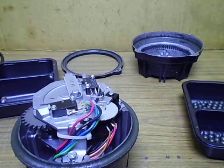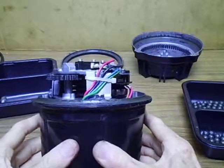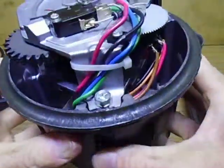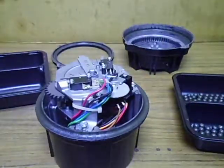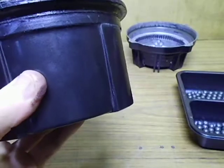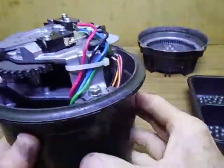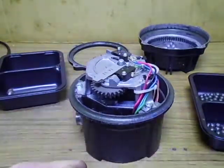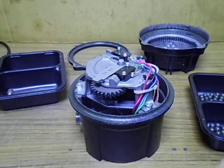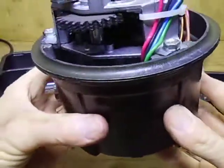I'm going to end the video here and get back in contact with the customer to see what we're going to do from here. I thought it might be a brake lockup or something, but the motor isn't even turning - and now we know why, because there's no power to it. I'll strip this right down; he mentioned wanting a complete service, so I'll verify that with him now that we know the problem. Catch you next video.